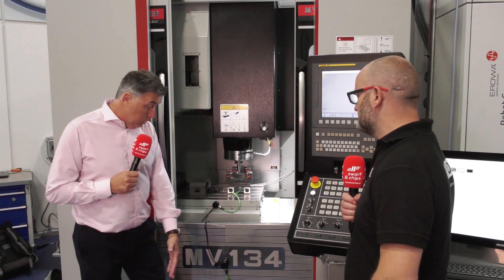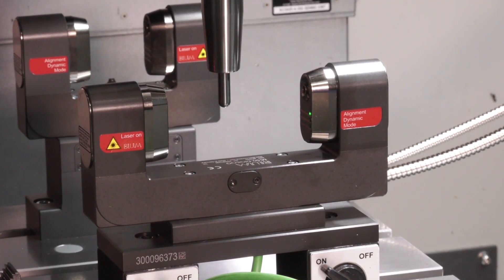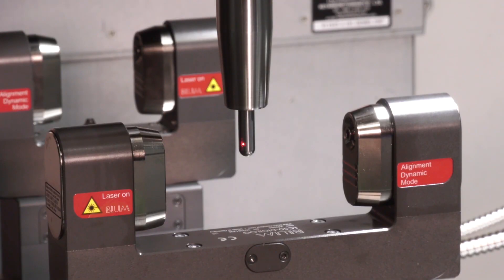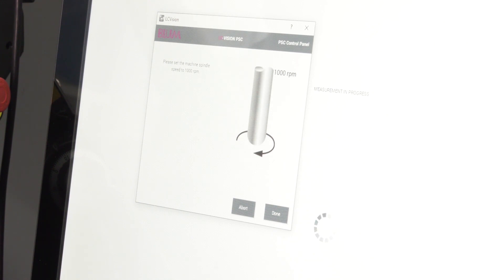We just saw the guys fitting this and it took less than five minutes — no time to set up at all. Can you walk us through the inspection we saw on the computer? We install it on the table with magnetic blocks, all cables run through to the software interface. Then we use a precision calibration reference tool, put it into the laser beam, and run the spindle through a series of speeds — in this example 1000, 2000, and 3000 RPM. At each speed the software checks the harmonics of the vibration and the thermal expansion stability.